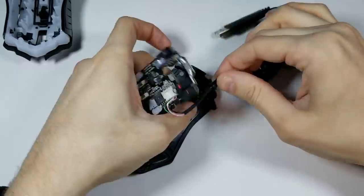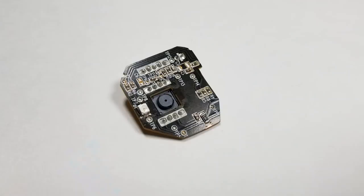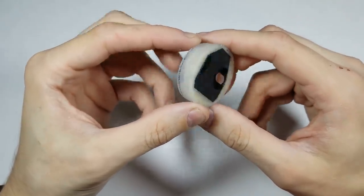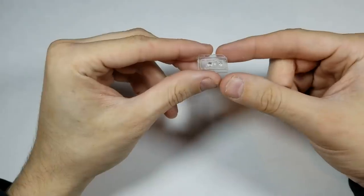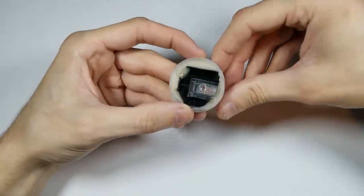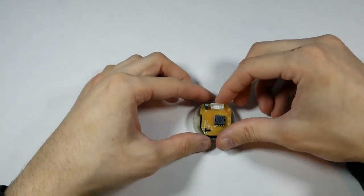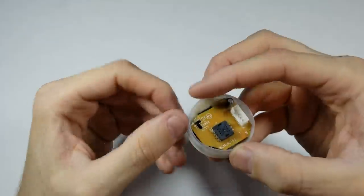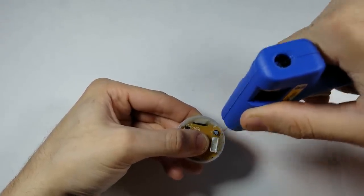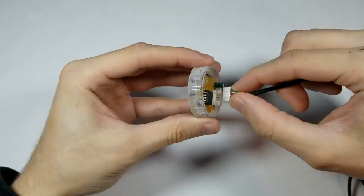Theoretically, all we need to harvest and maintain was the optical sensor within the mouse. The optical sensor is that red laser that shoots out from the bottom. The optical sensor reads the direction the mouse is being moved to and from. This was hands down the most challenging part of this project. Our objective was to find a mouse PCB, aka the mouse's main board, in which the optical sensor took up very minimal space, was in close vicinity to the USB cable that plugged into the computer, and had the wiring layout far enough from the other buttons on the board. The reason being is so we could physically cut the board out using a Dremel and harvest the optical sensor and USB connection on a slimmed down modified board, removing those unnecessary components we won't be using.